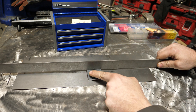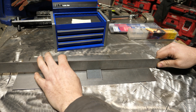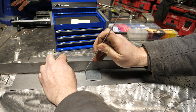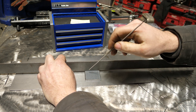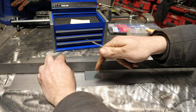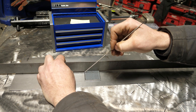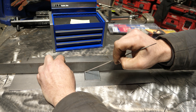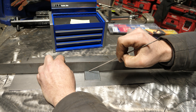This is 1/8" steel on 1/4", but the same would hold true with thinner material. One of the things you'll find is — and I've got this little mini rod right here — you're going to have to run a rod angle where, rather than trying to hit halfway or slightly favoring the upright plate, you come in so your arc is hitting the thicker of the two plates more than the top plate. It may also help to run your bead out a bit away from the thinner plate and then bring the arc over, keeping the heat and arc more on the thicker plate while only weaving into the thinner material.